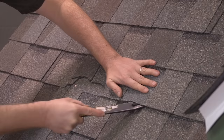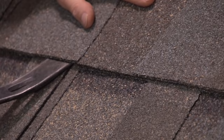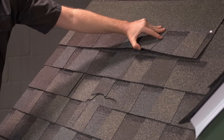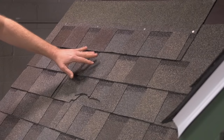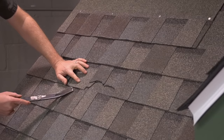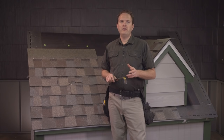On a newer roof you'll need to be careful and use your bar to carefully work between the shingles to separate them. You don't need to worry about damaging the shingles you are replacing so much, but be careful not to tear into the good shingles that you are leaving. If you do damage another shingle, be sure to go ahead and remove it and replace it as well. Keep in mind that the shingle is glued both to the top shingle and to the one below it, so make sure to separate it all the way around. You can just slide the flat bar in like this and slowly pry the shingle loose.